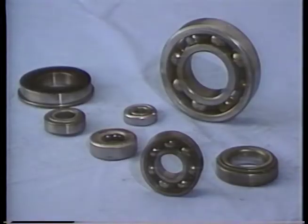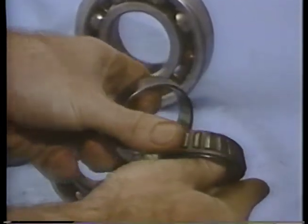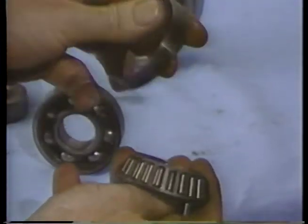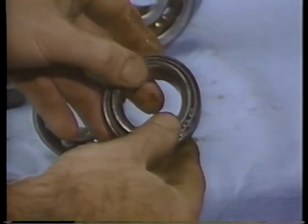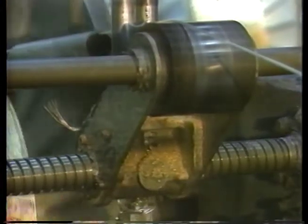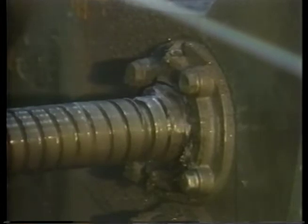In anti-friction or rolling element bearings, the rolling elements, balls or rollers of some kind, roll between inner and outer races or rings. There is often a cage, retainer, or separator to keep the rolling elements in place, aligned properly, and separate so they do not rub on each other. Under the right circumstances, both kinds of bearings can last a long time, but under the wrong conditions, neither type will last. Let's look at what the wrong conditions are, so you will know what to watch out for.